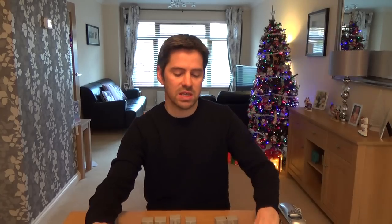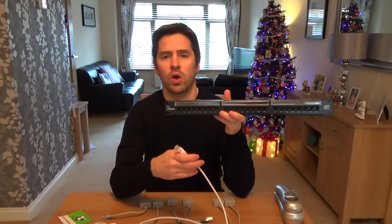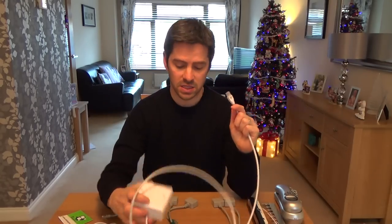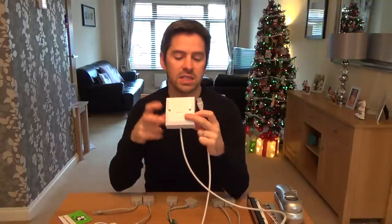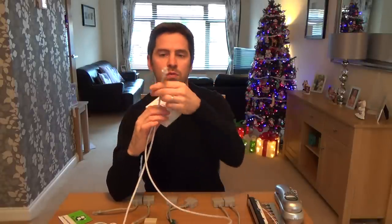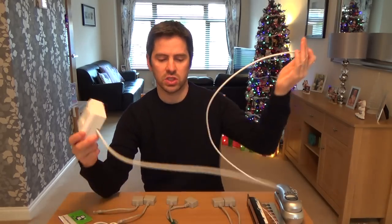You're going to have to use your imagination here. You may have wall sockets on one end and RJ-45 plugs on the other end that plug straight into your router. If you're in an office, you might have a patch panel in your comms room with wall sockets in all the other rooms. You might also have just an Ethernet cable with RJ-45s on both ends. If your lines terminate in sockets, you won't need to buy anything additional other than the economizers themselves.